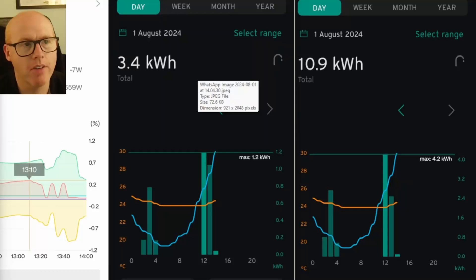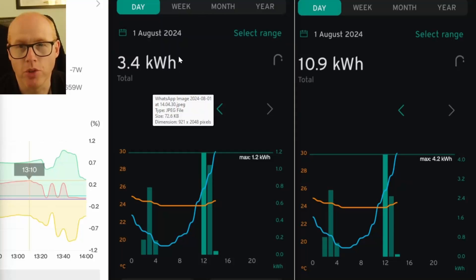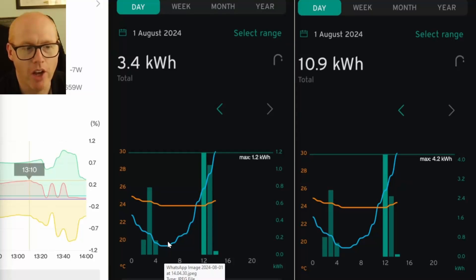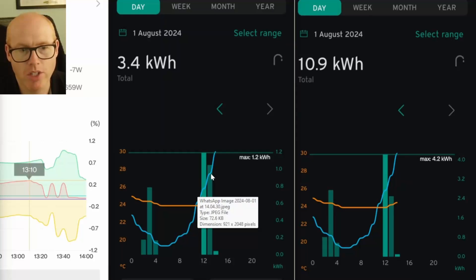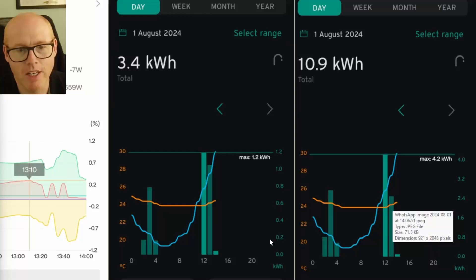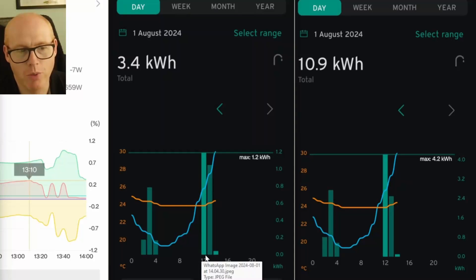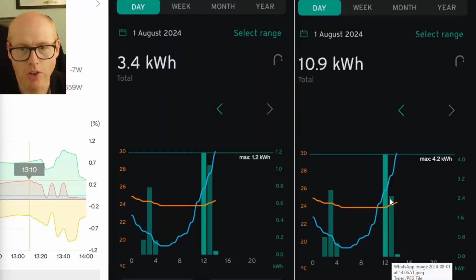Is this test a failure? Not really — I set out to show a heat pump-connected cylinder could easily reach 55 degrees; it can clearly reach 60 and even 64 degrees. Looking at the Vaillant app data, here are the screenshots showing electrical consumption versus hot water generated. You can see the early-morning cheap-rate cycle, and then my test cycle starting around midday. The first hour — 12 to 1 — used almost the same electricity as 1 to 2, but look at the discrepancy in how much hot water is generated: as flow temperature increases, the process becomes less efficient.